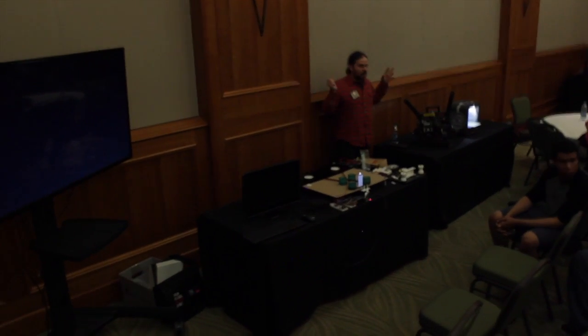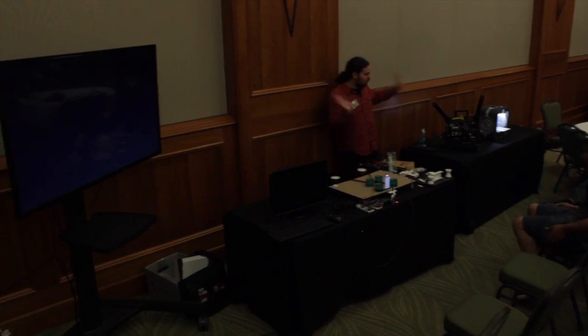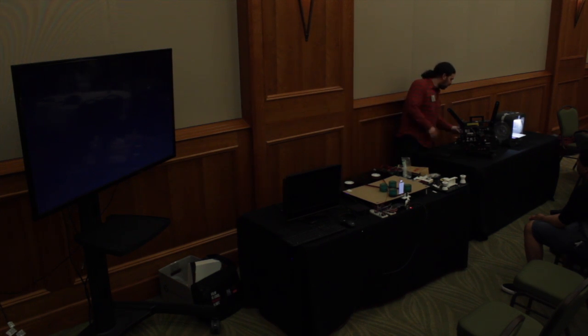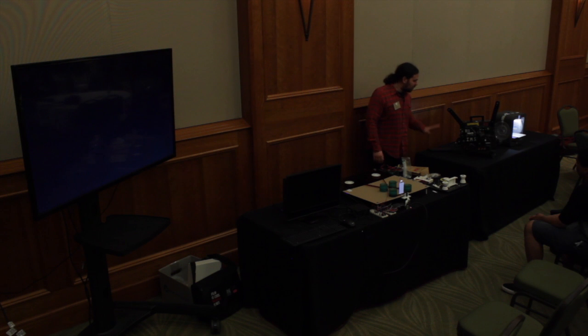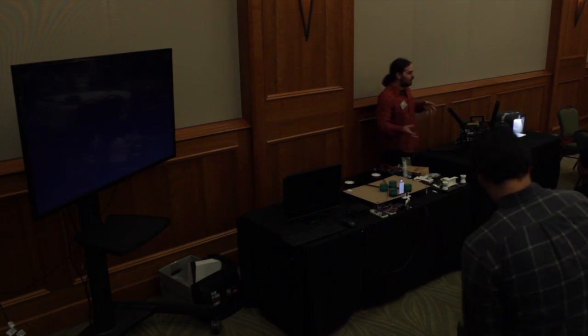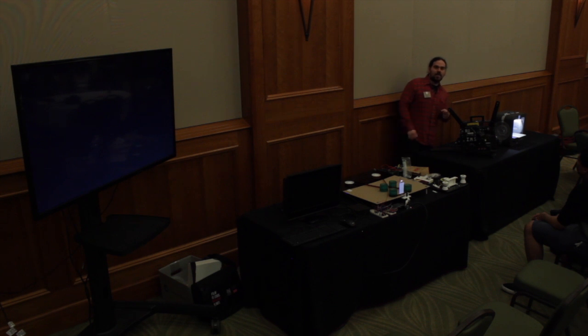We found that we were already packing up so much stuff on our way here that we left the projectors back in Rochester, but Robert had a 16 millimeter projector in his office, so this is a 16 millimeter film projector. I passed some of that film around. A lot of the early scanners were known as telecines. The way a lot of these worked, there was one called a film chain telecine, which was essentially a retrofitted projector that had a CCD camera on it. And then they would do something called a pull down to be able to replicate the frame rate of film in NTSC video.